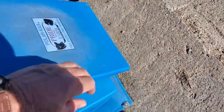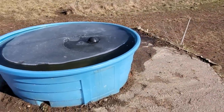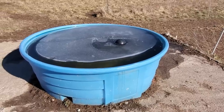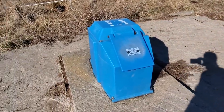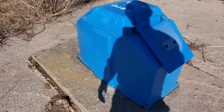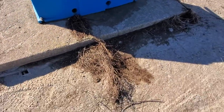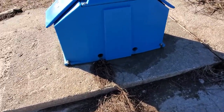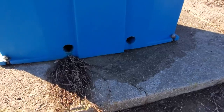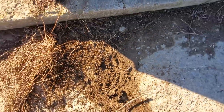You've only got two drinker points — one on each side. With my 400-gallon tank I've counted 17 cows around it. I wish I hadn't put that frost-free tank in — that's $750 and a lot of work. I raised it up above the pad so in winter when cattle drank and water flowed around it, it wasn't freezing where I couldn't shut it off. If you raise that platform up, all the debris runs off and you can still get to the drains. There's a shutoff plumbed in — there's a steel plate under there, that's how long it's been since I used it.